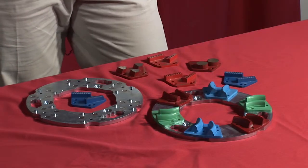Our 735, our 780, or our 780 remote control machine. These diamonds come in 30/40, 60/80, 120, and 140, and can be used in the initial polishing stage when you have a very hard cap or a very hard cured concrete surface.